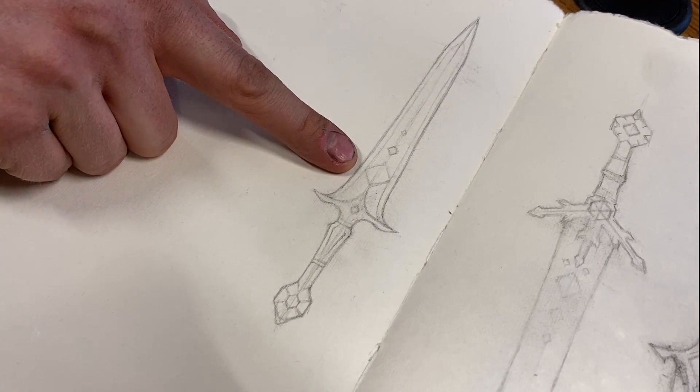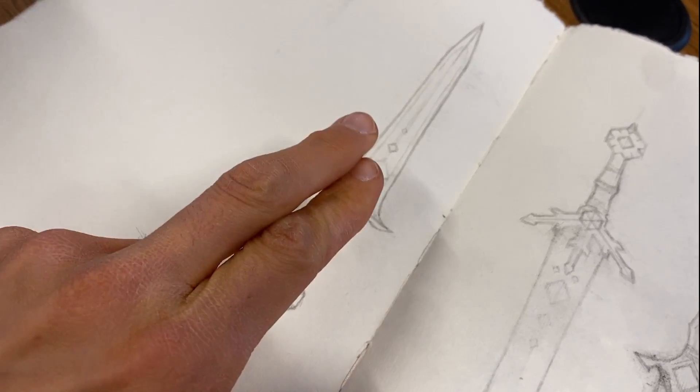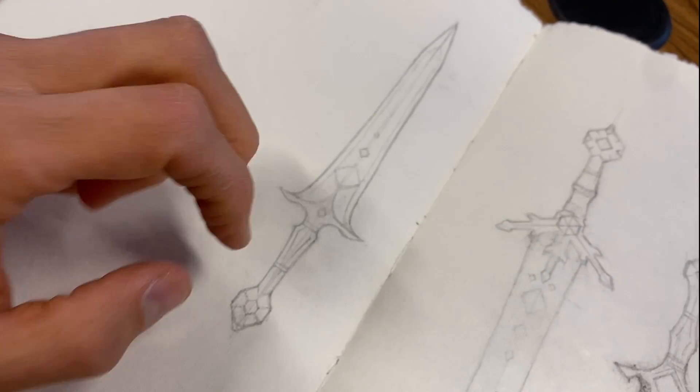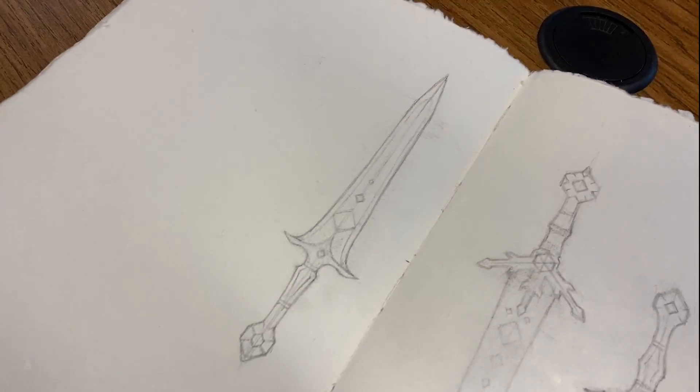That might be like an inch and three-quarter. And then in terms of thickness, tapering both in width and thickness — three-sixteenths-ish. A rough doesn't have to be crazy crisp diamond cross-section. Might need to call Steve Schwarzer. You can always work this one down too and have it tested — we'd want to see if there's any pattern distortion and stuff.